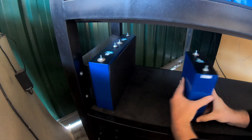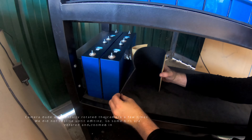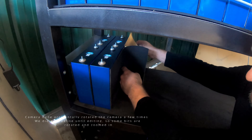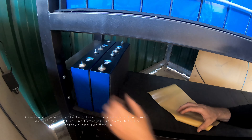These cells have an extra sticker on the positive side that tells you which side is positive — look at these ones, that's the negative, that's the positive. It helps us not to wire them up wrong. I'm going to use those stickers to align all the batteries, and before we install the bus bars I'll do a sanity check on the polarity of every single one. One extra benefit is it'll help prevent rub-throughs — this plastic isn't the most hard-wearing and with expansion and contraction you could end up rubbing through the insulation, so this gives us an extra layer of protection.